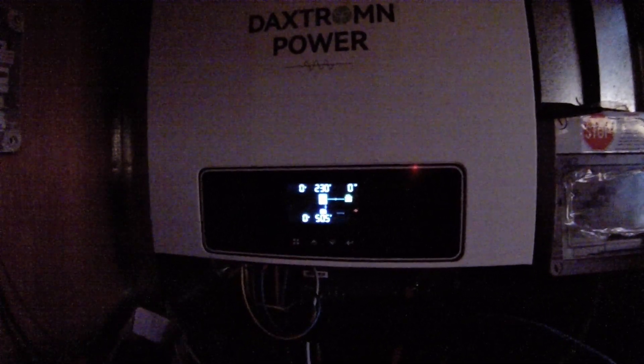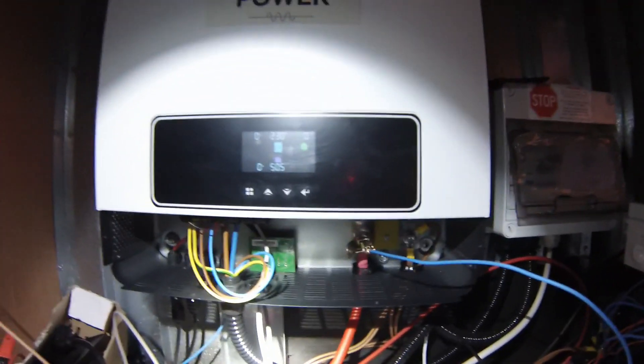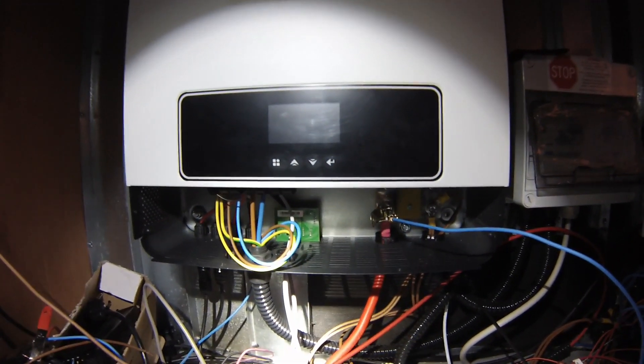The three heavy fans underneath will start running solely off the battery. I've seen this a couple of times — it actually drains the battery. So on a rainy day when you're connected to AC power and hardly producing any solar input, it will drain the batteries if you have it set to CSO or OSO on the battery charging priority.